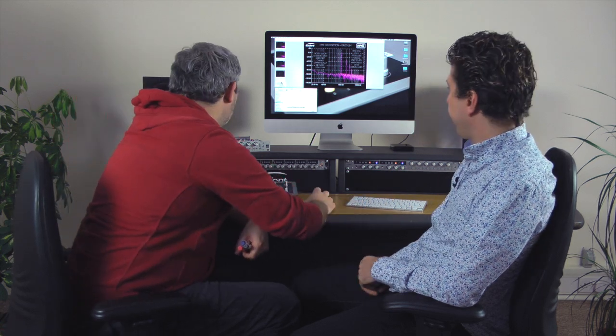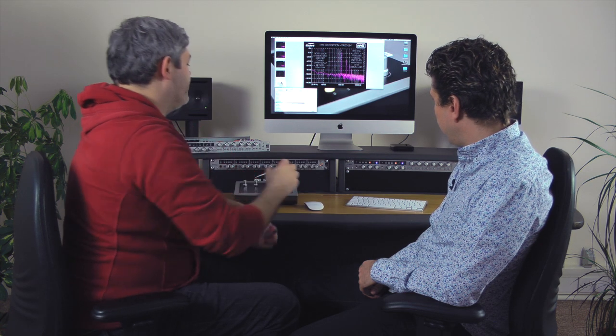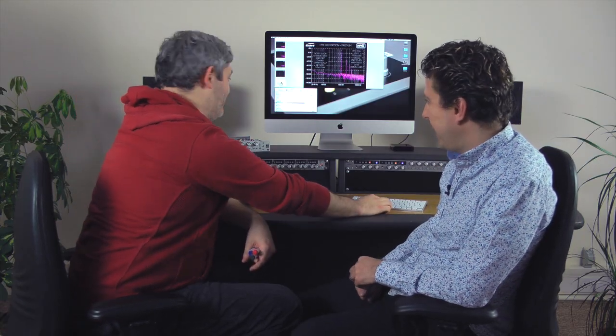So what else have we got? I'll probably show going over the top really with some electronic drums - 808 drums which we're effectively using as a two-track, and then running that through these to show how far you can push the distortion. The nice thing about them as circuit blocks is that if you don't go over their clipping point, they're very very subtle saturation and tonal enhancement tools. But if you deliberately overdrive them, pushing a lot of amplitude into the MOSFETs and the gain stages, they crumble - and the transformer in particular just crumbles completely and it becomes almost like a fuzz pedal. Probably best to show.